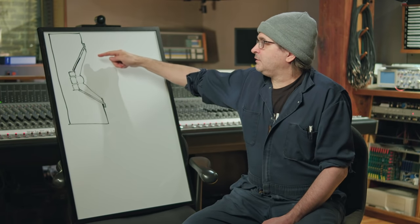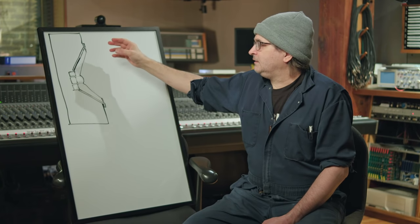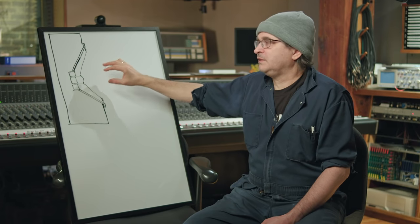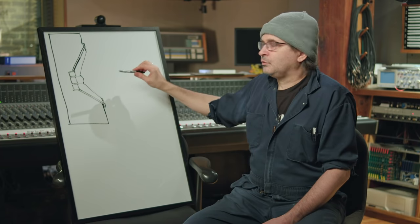As you move out toward the perimeter of the speaker, there are a lot of other effects that creep in. The speaker itself can ripple or crumple. There can be a harmonic mode generated around the perimeter of the speaker. The mechanical installation can cause noise or damping. All of those things argue that the perimeter of the speaker is going to be a less accurate representation of the input signal than the center of the speaker. And all of those things argue for pointing the microphone toward the center of the speaker.